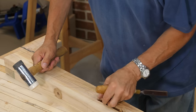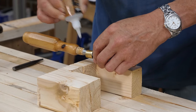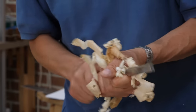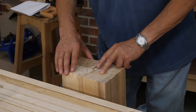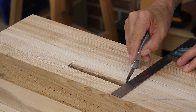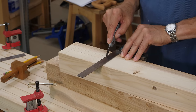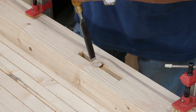The ferrule coming loose was pretty annoying but I persevered. To fix it, I slid the ferrule off and dabbed some superglue around the section underneath, then wiggled the ferrule back into place, wiped it clean with some shaving, and used a center punch to indent the brass of the ferrule into the wood of the handle. I gave it another wipe clean and got back to work. I picked the configuration I wanted for my legs and drew a triangle to help me keep track of the orientation, then I transferred the layout markings onto the other legs. Then I chopped the rest of the mortises — but look out for how I dealt with the knot in the next section.